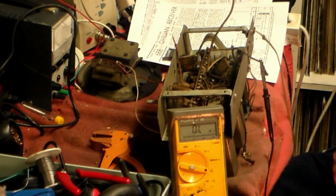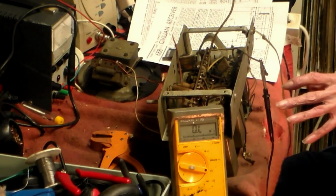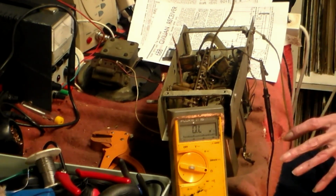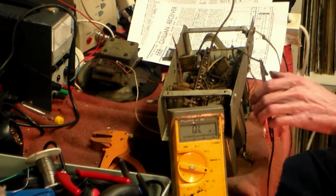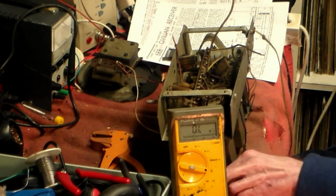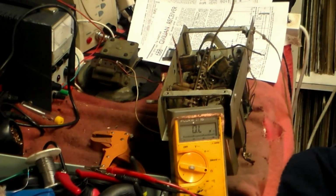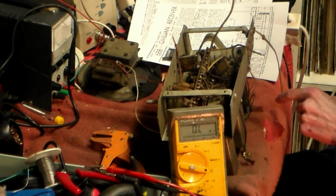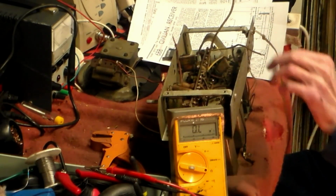So that's our next port of call, I think. So get the power supply working. Remember, PAIR: power supply, audio, IF, RF, going through the set. Okay. And so now we've got to put in capacitors and of course a couple of resistors as well. I think it might work with them as they are. I don't know, but certainly R15 needs to be looked at or changed.